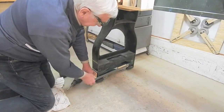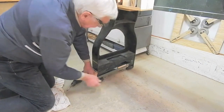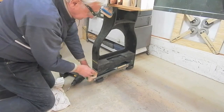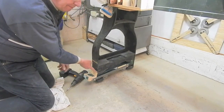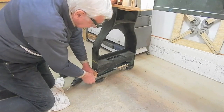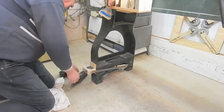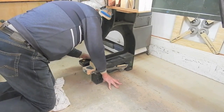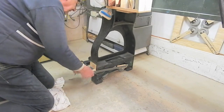When I pry down on the lever, the caster acts like a fulcrum and it jacks the lathe off the floor. The pedal rocks, and I've added a little aluminum strip here as a latch to lock the pedal down.